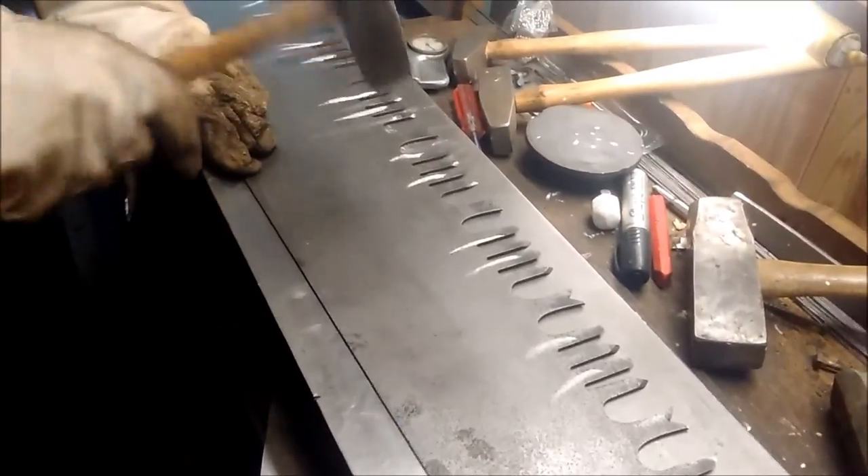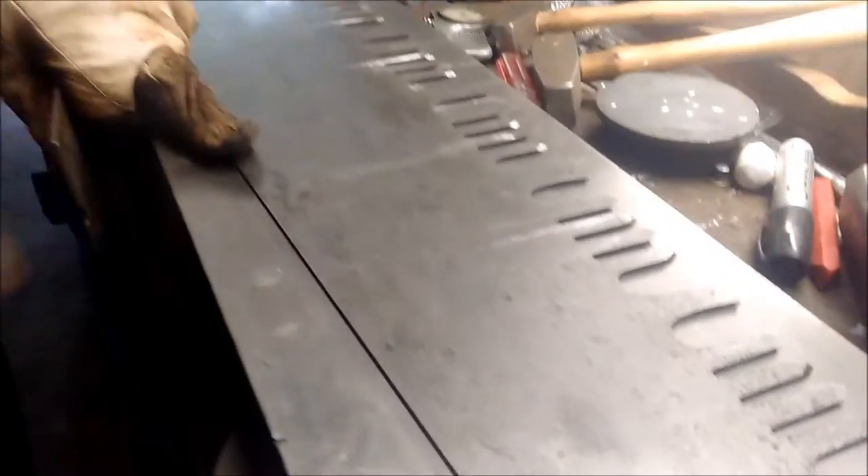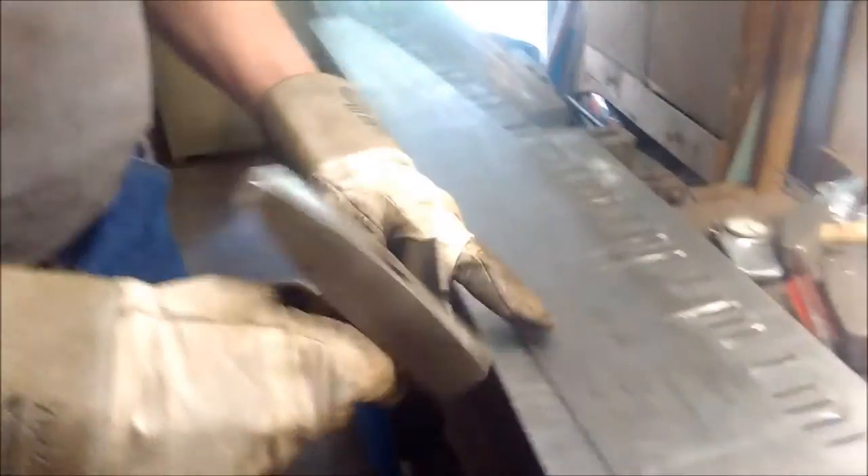Right there — I'll hammer down. Get that high spot down. There's a little bit of a high spot right there, get that down. A little more right there. Now I'll check — see if I can run my eyeball down the back of that saw, see if it's straight. We'll still have some back in this area. A little more right there. Now it's pretty visible right here — it goes across, there's a lump right there. The ridge is going in this direction, so I'm using the long face of the hammer in that direction.